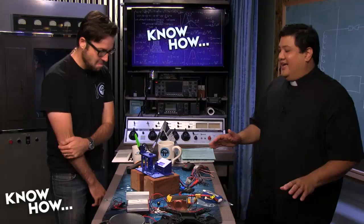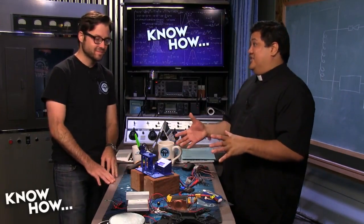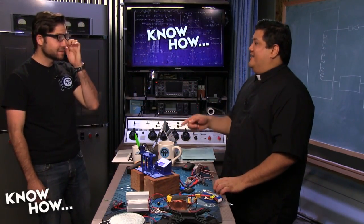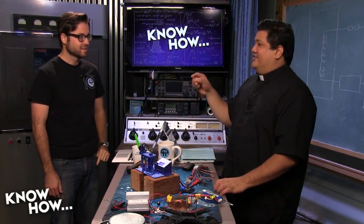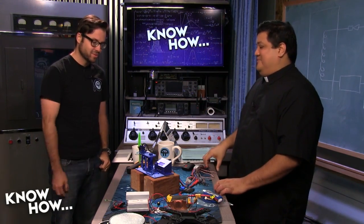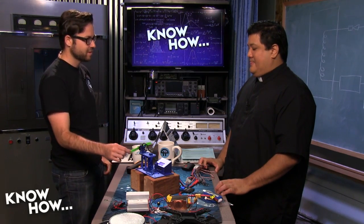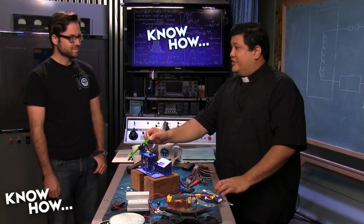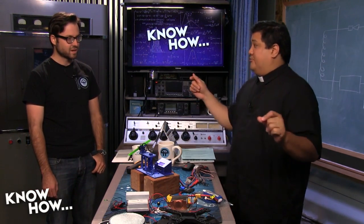Seriously, not in here. I actually had to build a new cage around the props because I was afraid. Bulletproof glass around it. One of the props snapped and it embedded itself into 1/4-inch drywall. It just went through. So now we realize we need to use carbon fiber props because these flex too much, and at the top limit of their thrust, it just snaps the props.